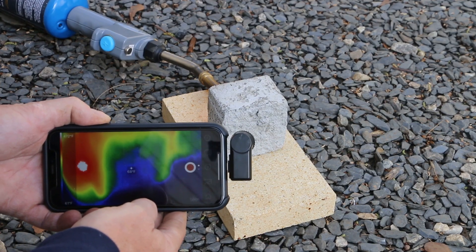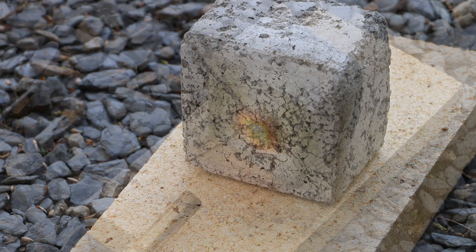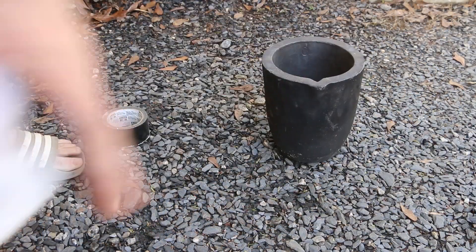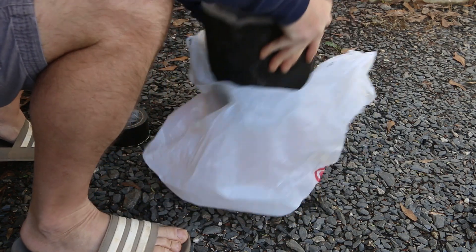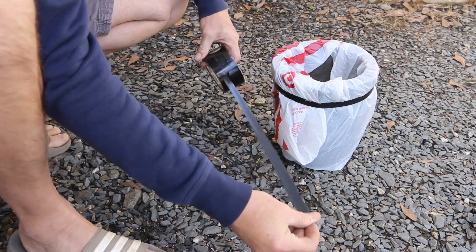That's pretty cool — literally. That intense heat hitting the block right in that one spot did degrade the aircrete just a little bit. But because this furnace is going to spread that heat out around the crucible and give it something else to absorb into — being the crucible itself and the metal inside it — I think the aircrete should last a pretty long time. But when it breaks down, I can just pop it out and recast. Even the insulating materials inside of those massive steel furnaces eventually break down and have to be replaced. To prep my crucible to serve as a form, I'm just going to put it inside a plastic bag and secure the plastic bag with duct tape. I want it to be flat around the crucible so it doesn't get stuck in the aircrete.